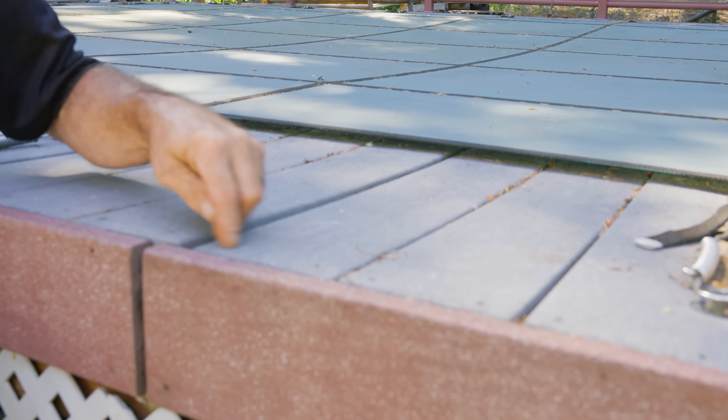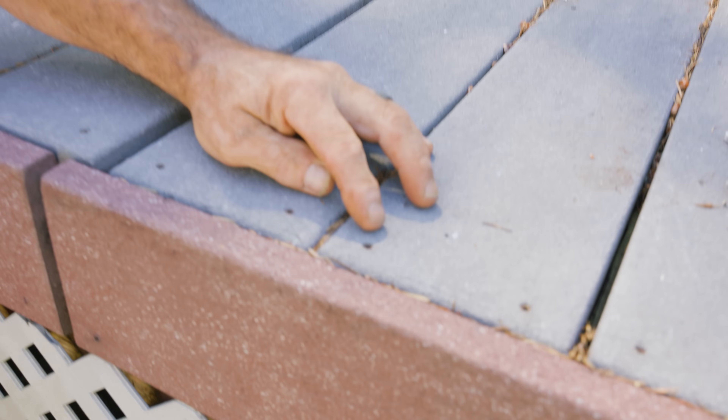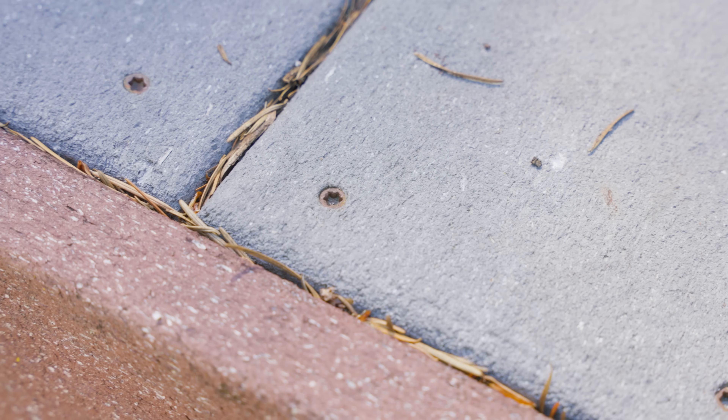When the frame is shrinking and the composite is expanding, your fasteners start to twist. That's why we now use a lot of stainless steel fasteners in our finish work — carbon screws have a tendency to snap. If we went to take these deck boards off, all these screws would snap. They've also lost all their colored gray coating and you can see a really fine layer of rust now. Unfortunately I didn't use stainless steel screws on this deck — I was on a budget and used what I could afford at the time.